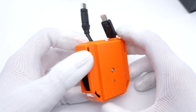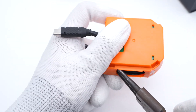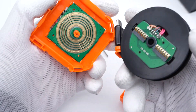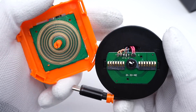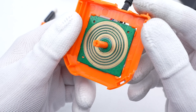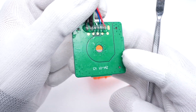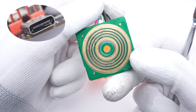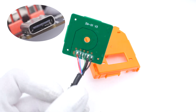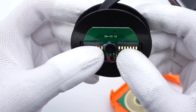Finally, take a closer look at this orange case, which is fixed by a screw. The retractable USB-C cable is stored inside. Those metal contacts on the right PCB are connected to the metal grooves on the left PCB. The internal USB-C cable is soldered on the back of this PCB, and is also directly connected to the USB-C connector on the internal PCB. The retractable USB-C cable can be easily retracted when you let go.